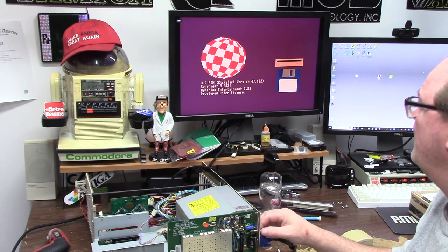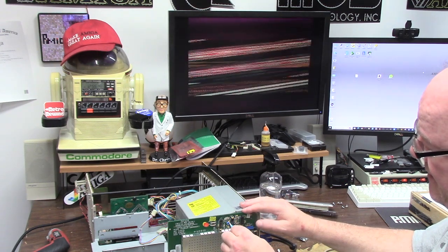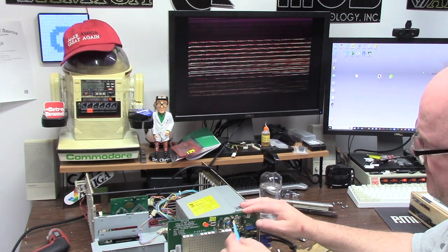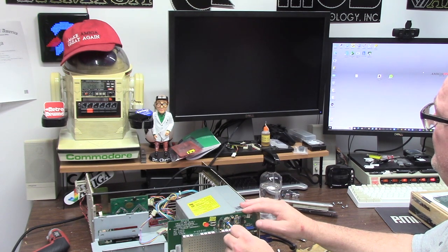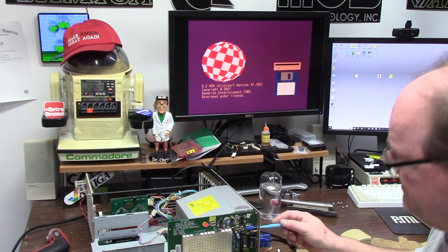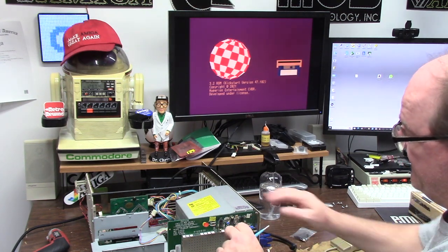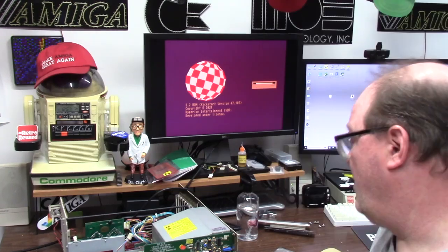Rebooting to get the ROM screen, then disabling it. There are some fine grain lines — that's open loop. I can adjust its phase. This is where you're supposed to hook an oscilloscope up to it and measure the 28 megahertz signal across the chip. Adjusting the rear phase — those pins 28, 14, and ground are your test points. Taking it out of open loop. It's pretty clear to me. It works.